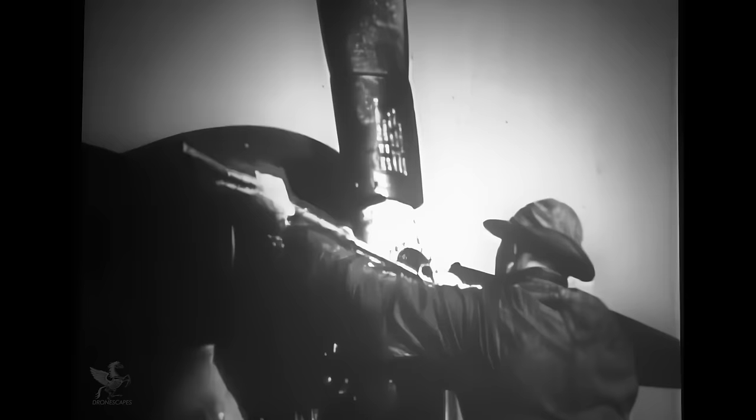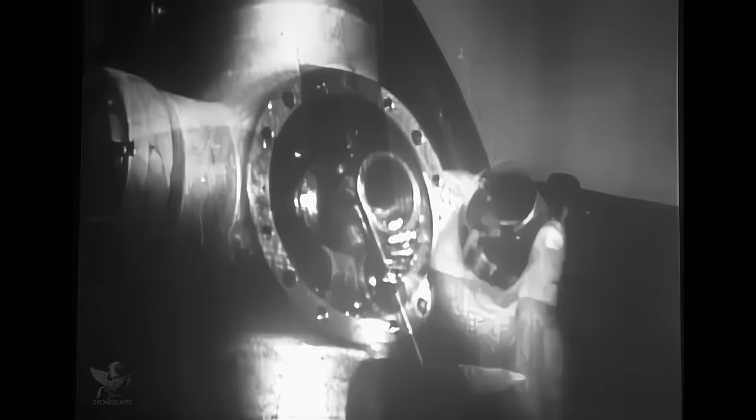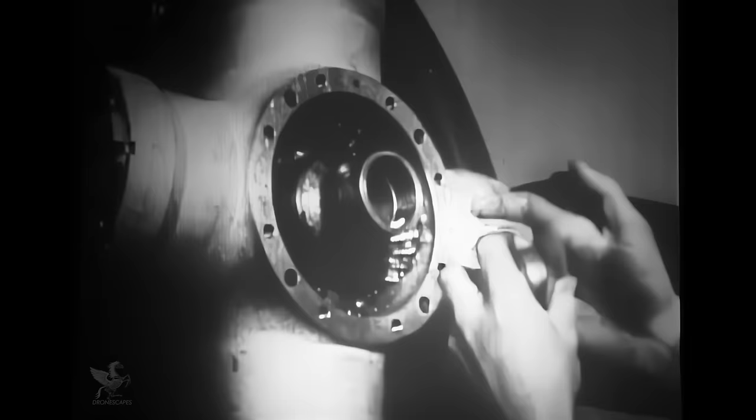After the nut has been drawn tight, insert the locking sleeve and secure with the lock pin assembly. Next, after cleaning, the brush assembly is put in place and the brushes checked for proper clearance on the slip rings using Prussian blue according to standard procedure.